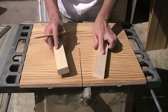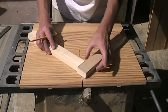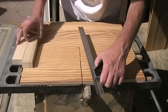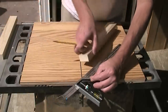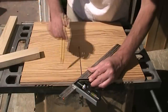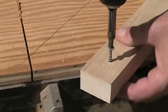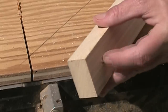I'm going to use one-inch thick boards for my two miter pieces. You could certainly use three-quarter-inch, but I think I like the extra height that gives me. Since I know that the front of this is square with my blade, I'm going to use my combination square and draw a 45-degree mark wherever I think is right, so I have a guide to set it up. I'm drilling some screws into these boards, but I only want them to go just to where they barely stick out at the other end, where I can feel that point.